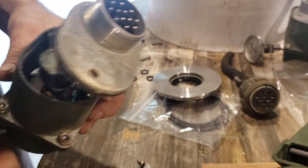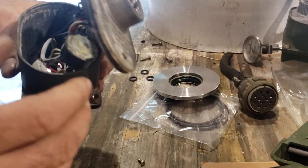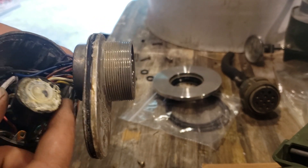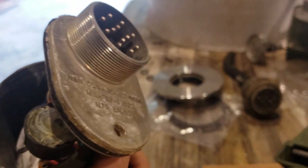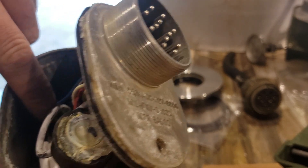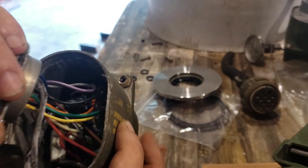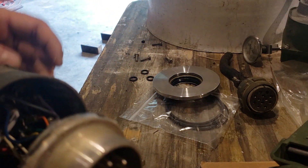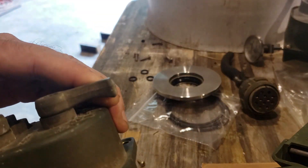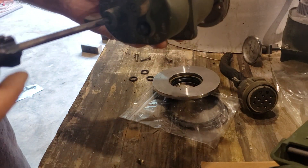You want to be careful not to pull all the wires apart if you're actually trying to repair it. This is the first time I've ever pulled one of these apart. This is the circuit breaker — there's only one — and it actually works. I've hooked this up to the harness in the truck and tested it. I've got power through the circuit breaker but no power coming out on the other side of the switch contacts. I'm going to pull out the contact board — I know springs and stuff are going to fly everywhere because all these levers are spring-loaded.